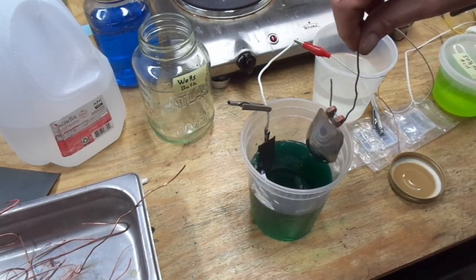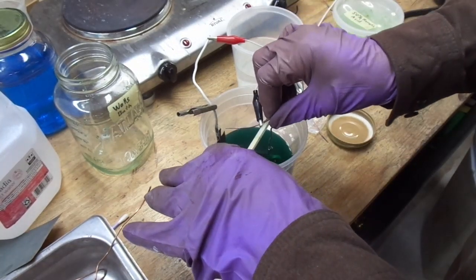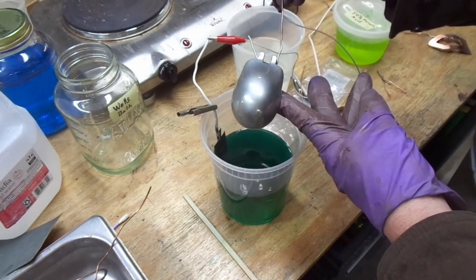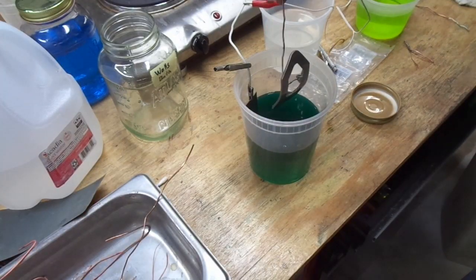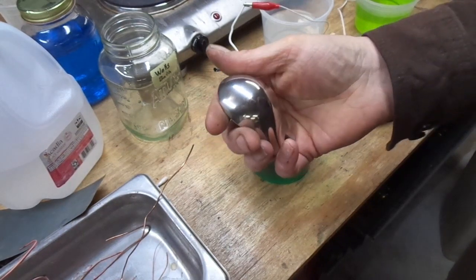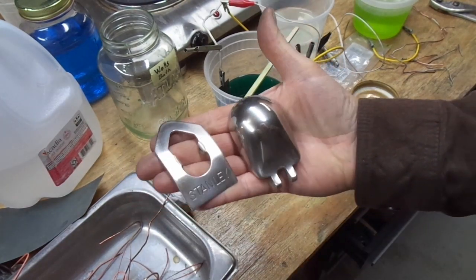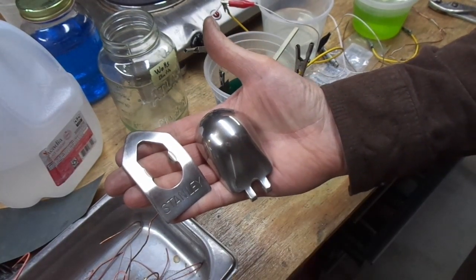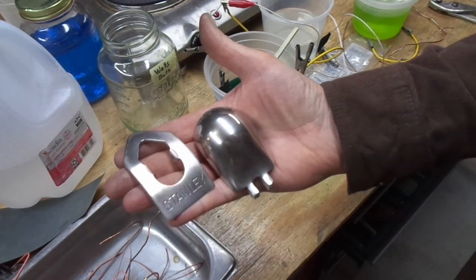I have the lever cap in the Watts bath — you can see that's coming out nice. It's been about 15 minutes, and I've been stirring and turning it on occasion. Looking pretty good. I have this piece next in the bath as well. I took a minute to shine up this piece — hit it with a little steel wool and buffing — and I think it looks sweet. Here are the two pieces after the nickel plating, and they came out pretty good. I put each of them in the nickel bath twice, about 15 minutes apiece at 3 volts, and polished and shined them up in between.